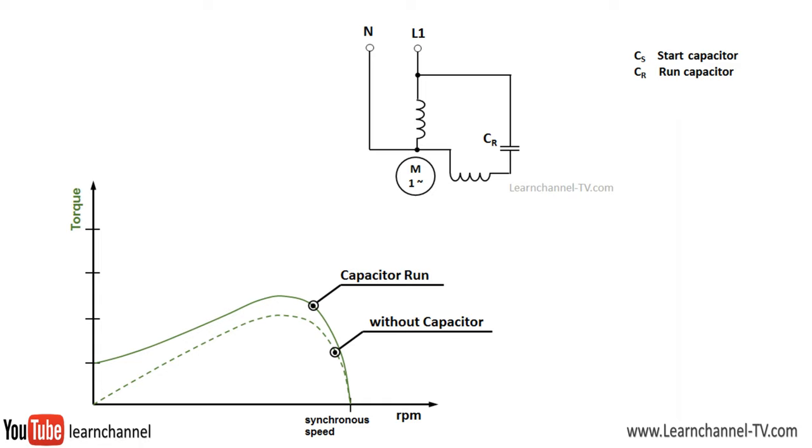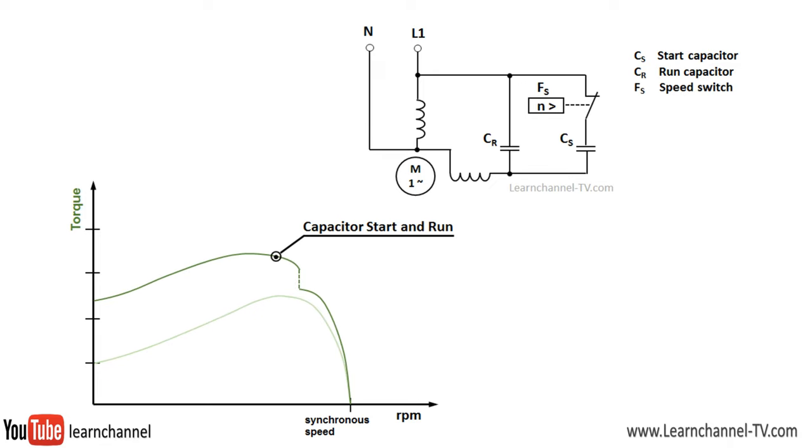The function of a single-phase induction motor is very similar to the function of a three-phase motor, so the characteristic curves are also similar. Several effects determine this curve, and you can mark the distinctive points. The problem with this motor is its low starting torque. With a simple trick, you can provide a starting boost: add another bigger capacitor in series to the auxiliary winding. Due to overheating, this starting capacitor must be switched off at a certain speed by a centrifugal switch.